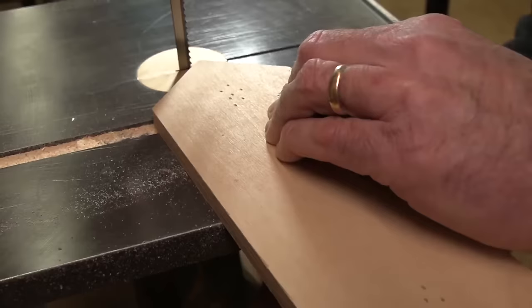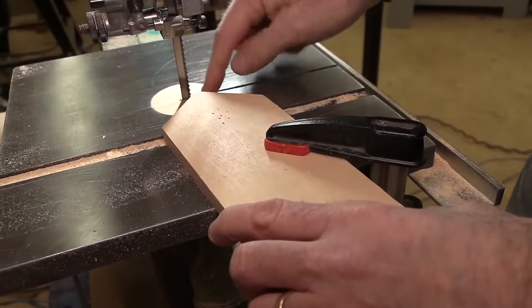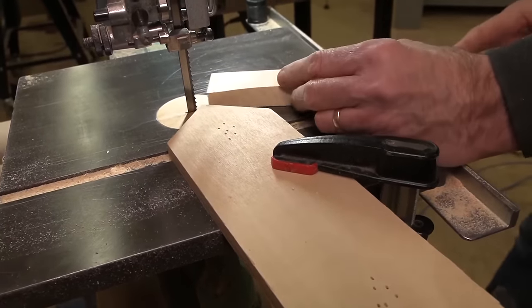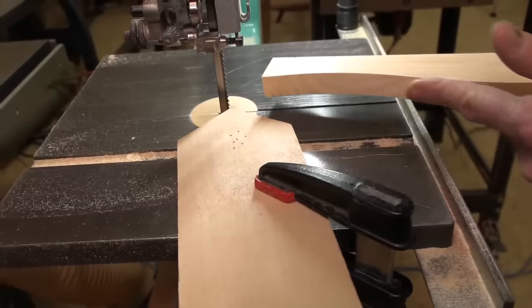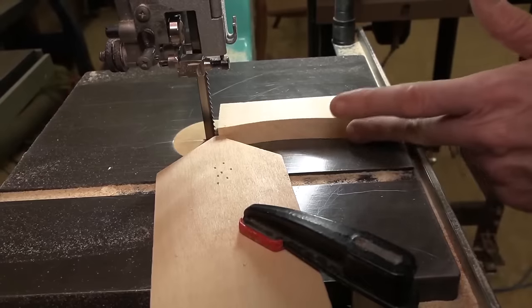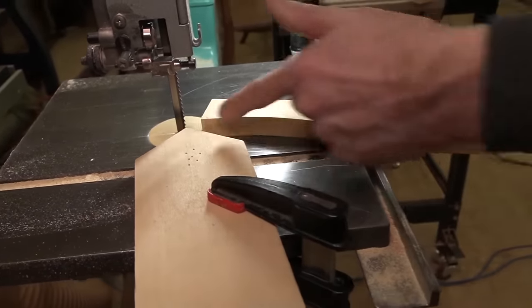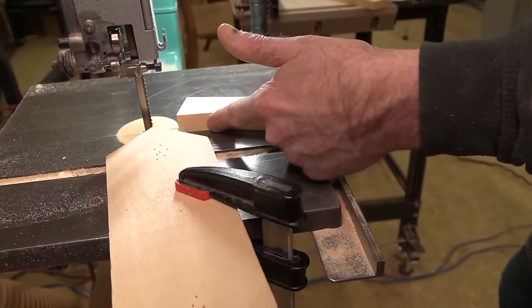Here we've got a little more room than we did last time, so that's a little easier. But make sure your point is slightly ahead of the teeth like that. And then you're going to make a bandsaw cut. We're going to come in here, and we're going to bear this curved surface on that point. So you've got to keep moving the back. It's almost like you're fishtailing in the back to keep the saw cut parallel to this curved line.